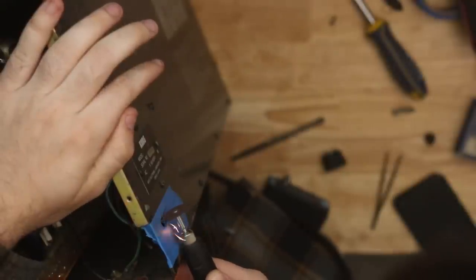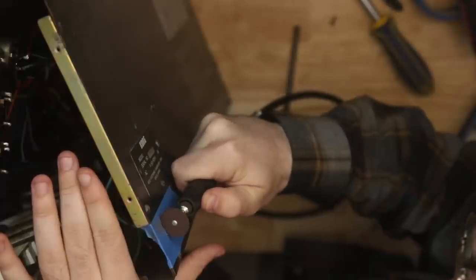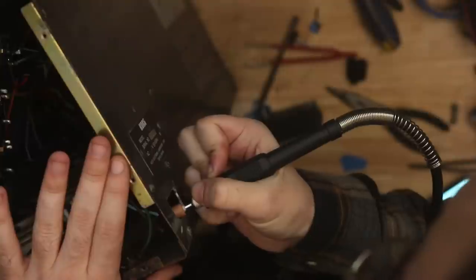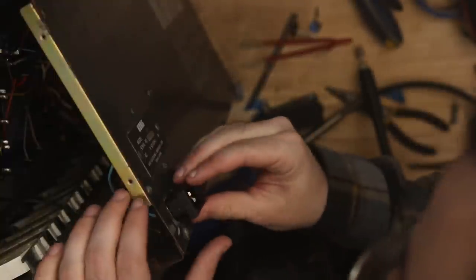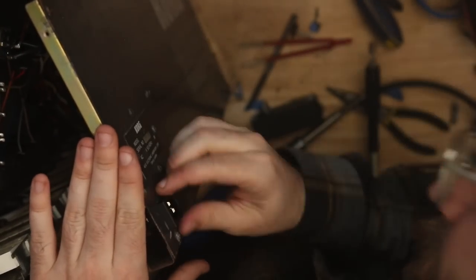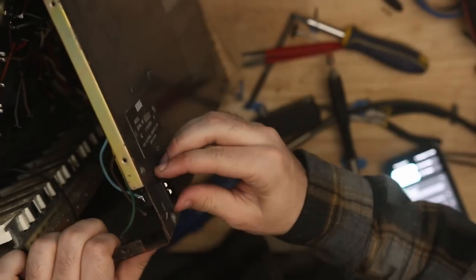But it took a little bit of trying and cutting and recutting, pushing the edges a little further, grinding them down so that they weren't too thick for the snaps of the IEC to fit in. But it happened pretty quick. I used less than one cutting wheel and then a grinding tool for only a few minutes. Ta-da! That sucker's in there. Nice and tight. Was that a horrible angle to watch all that? Great, easy. I'm not going to wire that up until I figure out the transformer.